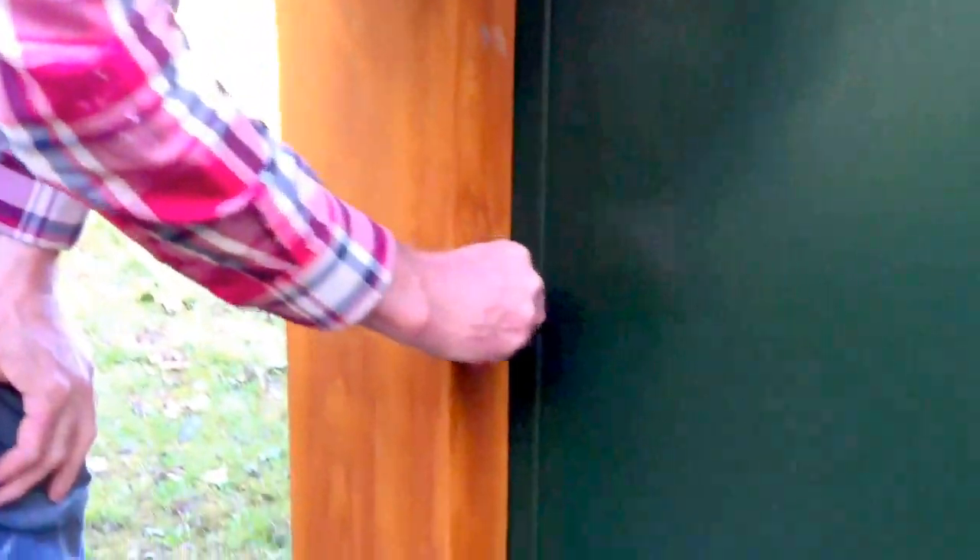It would be easier to take this corner off. If you take these caps off here and here, this corner will come off and you can run straight into the consumer unit — it's visible once the corner is taken off. So there's a conduit and you can feed your armoured cable straight into there. It's a little bit more work, but it will comply with regulation.